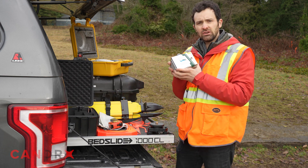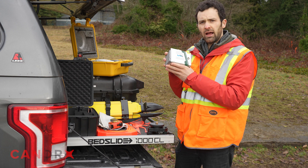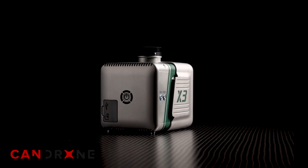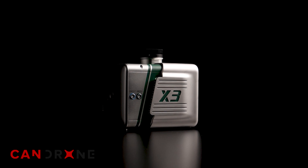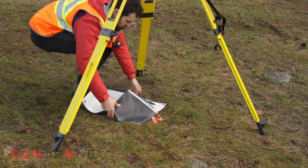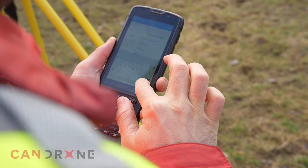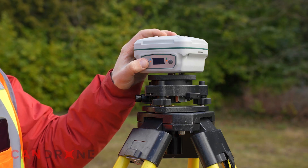I've got the X3H from Green Valley. This is a beautiful remodeling of this LiDAR unit from a previous generation called the V70. It comes with a LiVox Avia sensor and a 24 megapixel camera. There's a GCP target down underneath the tripod. I'm going to measure up the antenna height, set my parameters in the LP-1 base handheld controller, and then we're going to get logging.